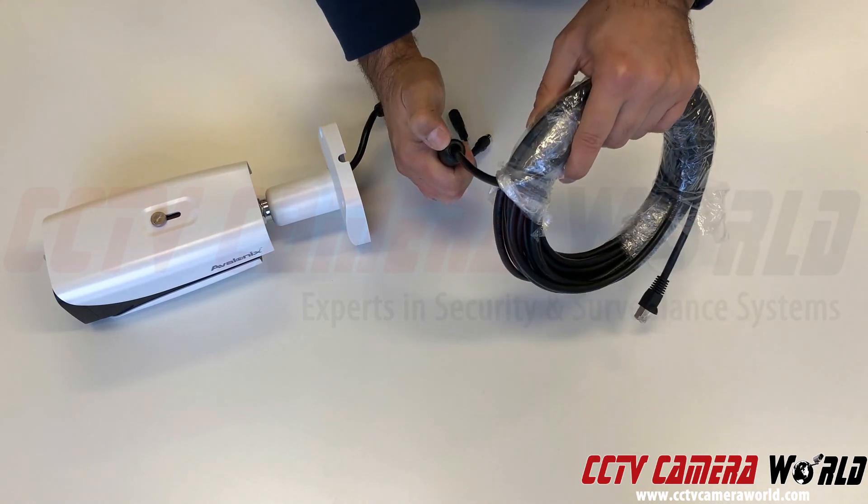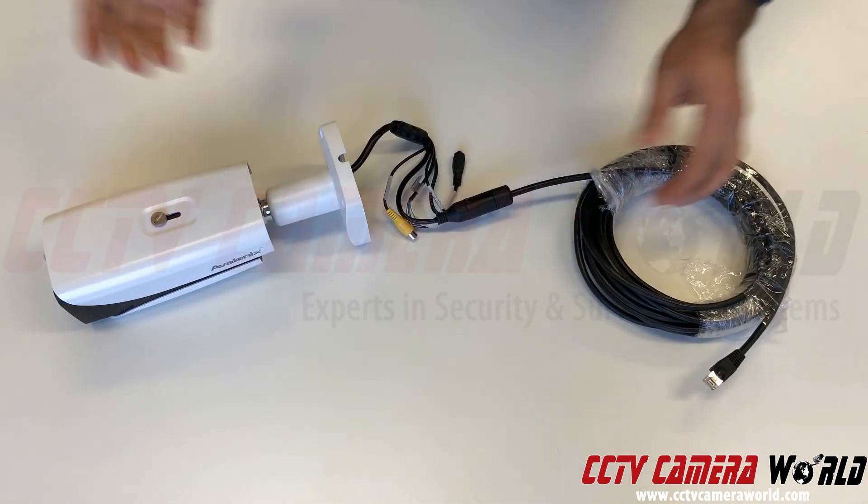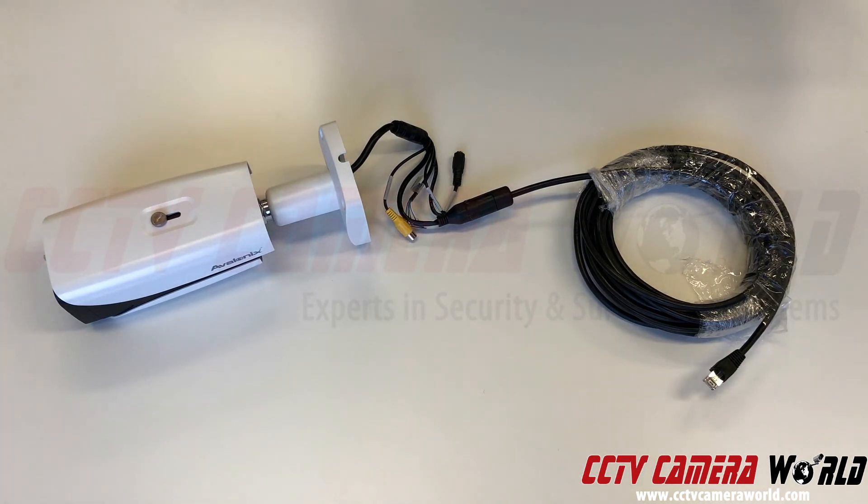It's really snug — no water is going to leak in there, and that's pretty much it. It's really important to put these on to make sure that your pigtail doesn't get ruined on the camera, which would also make the camera non-operational. In any humid environment or out in the elements where you have exposure of a pigtail, you've got to make sure you put the weather gland on. Thanks for watching.